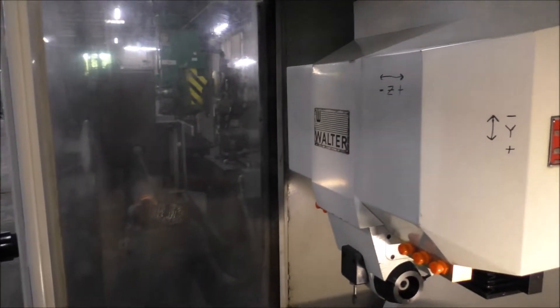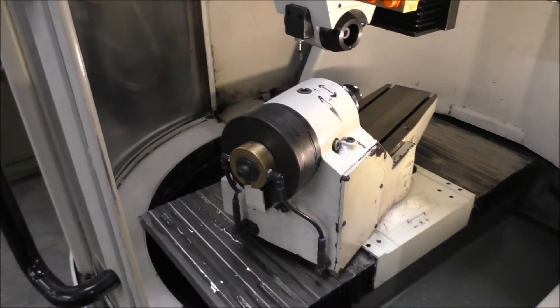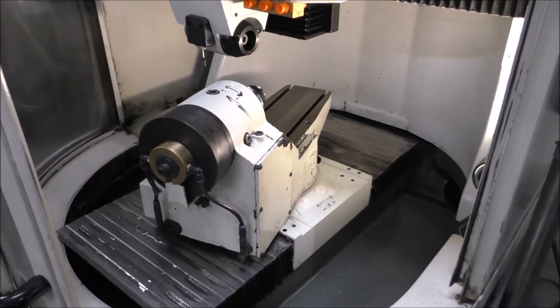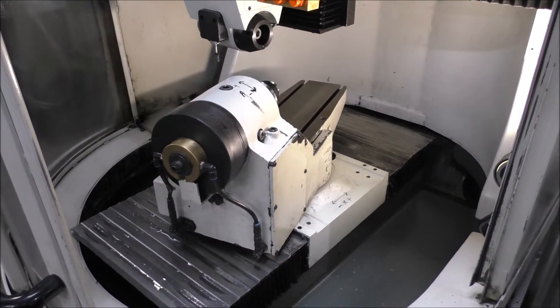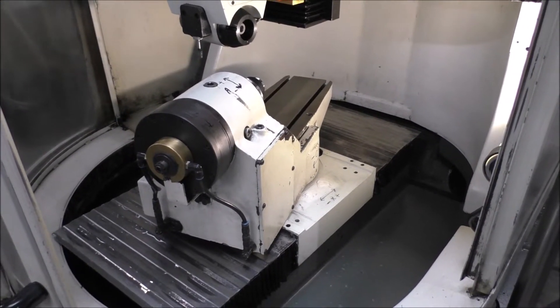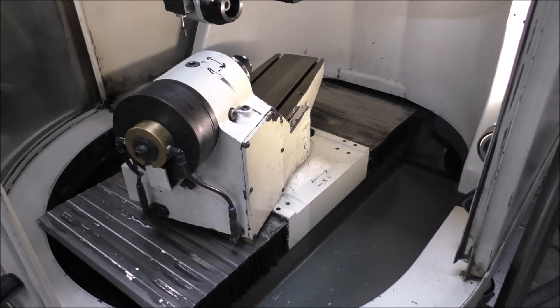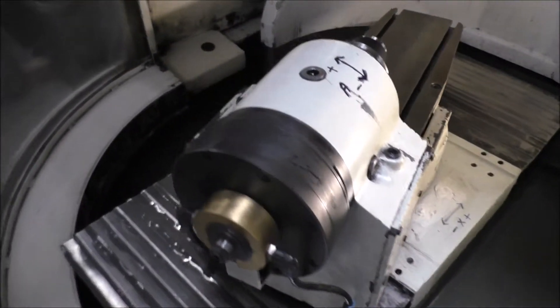When we run the spindle, it's going to be a little hard to hear just the spindle itself because we don't have any wheel packs in there. They're blowing air through it to keep out coolant and particles and other things of that nature. So you're going to hear a lot of hissing air, which is normal. I don't see any problems, but it makes it harder to hear the actual spindle.